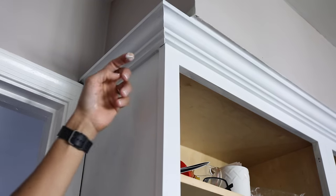The trash cabinet needed to get painted as well, so I used an oil-based spray primer on that and it looked much better — it was so full of food stains. Now let's look at what this kitchen looked like before. This is what it looked like when we moved in in 2010. We pulled out the old stinky cabinets, put new ones, but they were too dark — and now they're white. Some of you said you love white cabinets; some of you said white is so boring. But I don't feel there's anything boring about this kitchen. If something feels good to you when you walk into it, it's not boring. It can be simple — simple doesn't have to be boring, especially if you walk in and feel it's clean, light, and bright. That's a dramatic difference.